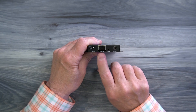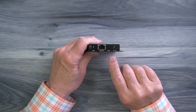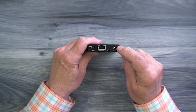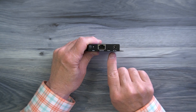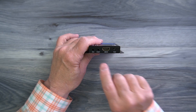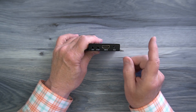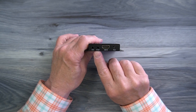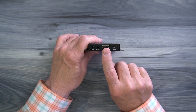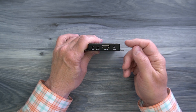To the right of the EDID switch is a LAN port where one end of the Cat6 or Cat7 cable between the transmitter and receiver plugs in. To the right of that is a power indicator and power port — plug the included power supply into a standard wall outlet, with the barrel connection plugging into the module. The minute you add power, the module immediately starts an internal power-on self-test, and when it passes, it lights the power LED letting you know the module is ready. On the other end of the transmitter you'll find two 3.5mm ports labeled IR In and IR Out — use the IR blaster labeled transmitter and plug it into the IR Out port. To the right is a full-sized HDMI port labeled HDMI In, which connects to whatever media device you'd like to share content from — always use a high quality HDMI cable for best results.